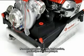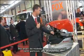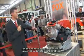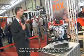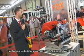Another special feature is the 20-litre fuel tank, located at the bottom, so that you can safely refill the tank while the pump is running, because if you spill any petrol or gasoline, it will not run over the cylinders. The gasoline tank has a special safety closure. When you open this, the gases are released first, and it takes a further turn of the cap to actually open the fuel tank.